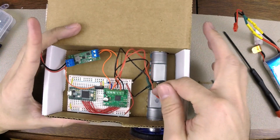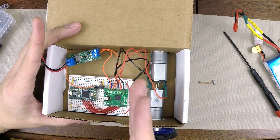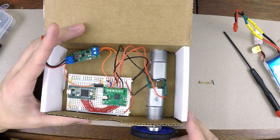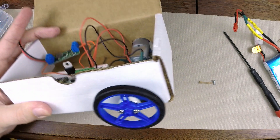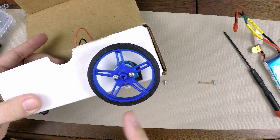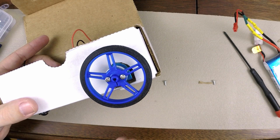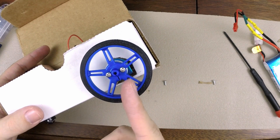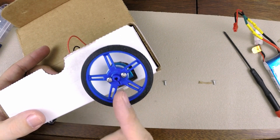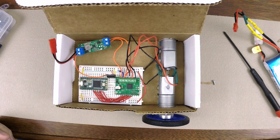In hindsight, I could have mounted these motors a little bit farther apart so that way they didn't need to be offset. And the final thing — the hubs. When you mount the hubs, make sure that the set screw goes on the flat part. You should have a D-style hub on your motor, so make sure that the set screw goes onto the flat part, not the round part. Enjoy!